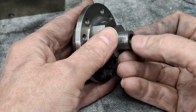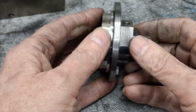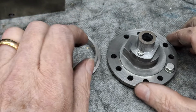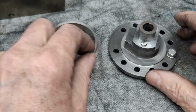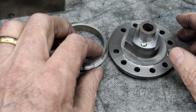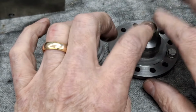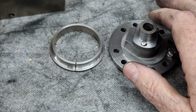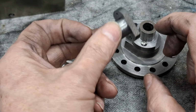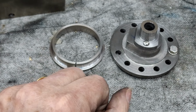So we're going to turn a cone that's 15 diameter and as deep as it goes, just backwards and forwards with the boring tool. Right. I'm going to go back to the lathe, make up these parts off this mandrel and make up the second little button that we need. I'll show you those when I get that far, when they're made. That's just plain straightforward turning. There's nothing for you to see on that. Once they're done, they can be put aside. We'll get these all sorted out and then we'll start looking at doing the back of these, getting these flanges to shape, and then these two bits, this one and this one, will be done. Right, I'll see you in a bit, guys.